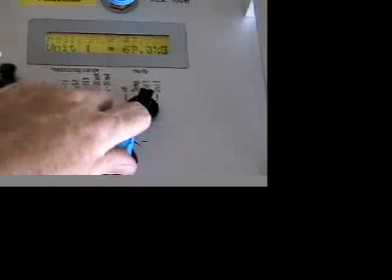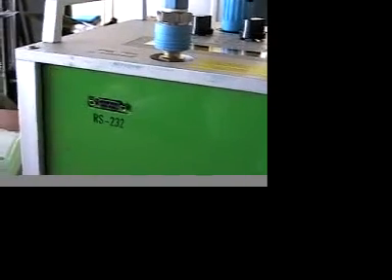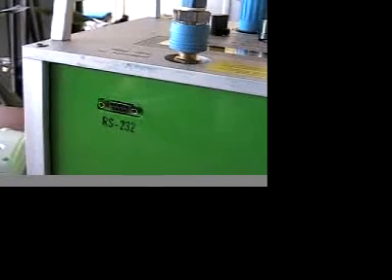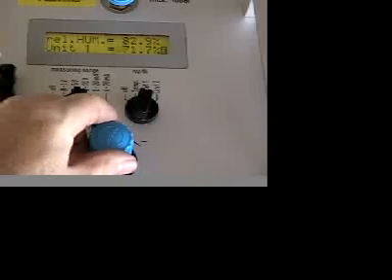Just watch as I adjust this — you can see how quickly the humidity stabilizes. You then have to wait for the sensor to stabilize, which is based on manufacturer recommendations. For an E plus E electronic sensor from Airtest, the time is typically about 30 minutes. If you would also like the calibration report recorded on PC, there is an RS232 port on the unit and software to interface to the Humor. It also allows you to make other custom adjustments on the Humor or actually adjust the calibration of the device yourself.